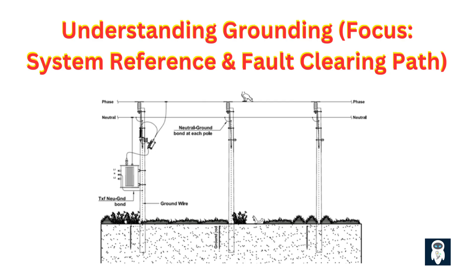Now let's talk about grounding. While safety is a component, grounding often has a broader meaning, especially in North American terminology like the National Electrical Code (NEC). Grounding involves connecting parts of the electrical system itself to a reference point, and very often that reference point is the earth — which is why the terms get confused. Grounding serves two primary purposes. Number one: system grounding — this involves intentionally connecting one of the current-carrying conductors of the electrical system, usually the neutral conductor, to ground at the source like the utility transformer and/or at the main service entrance of a building.